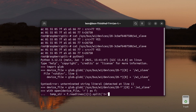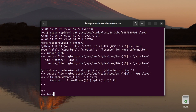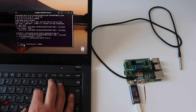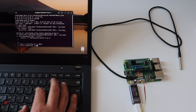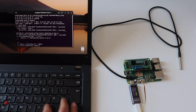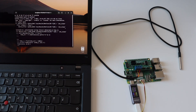For your convenience, this simple Python 3 script is available in the video description as a GitHub Gist, so you can copy and paste it. One quick tip: to break out and force a blank line in the Python 3 interactive CLI, press Enter twice. The measurements from the Python script are exactly the same as from the previous bash demonstration using the 'cat' command — 26°C. To be clear, the proper way would be to include this Python 3 script as part of the image through a recipe in your own layer.